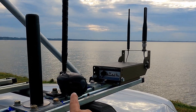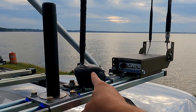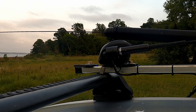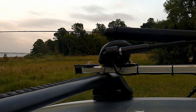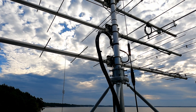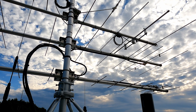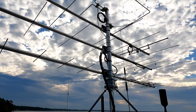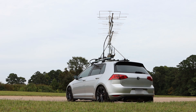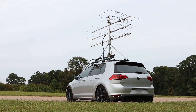This is also the new home for the Meshtastic node. All of my verticals are now on motorized mounts — these are Diamond K9000 mounts at all four corners. That way I don't have to decide which antennas to unscrew and remove before rotating the tower, because now all of the antennas are potential collision hazards with four beams up there, especially the ATAS. Instead of taking them off, I just lower all the verticals whenever I want to rotate the mast.